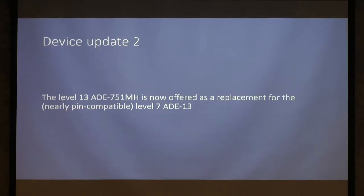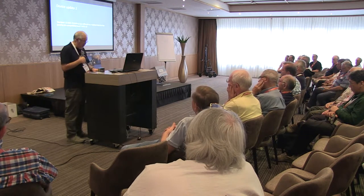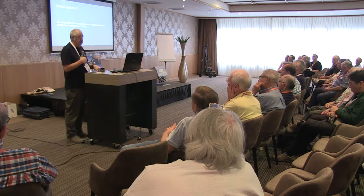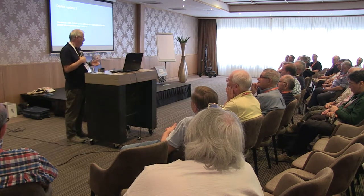Recently, I did an upgrade to the Iceni. This was based upon some suggestions by, firstly, a German operator, who I've acknowledged somewhere in the paperwork, I think, and then one of the ONs also asked this question: why have you used the ADE13? Well, as I told you, I had a few to play with. It's only a level 7 mixer, but I overdrive it at plus 13. The thought was that, traditionally, you can get more dynamic range out of a mixer if you drive it hard as a switch.